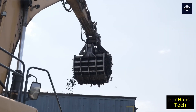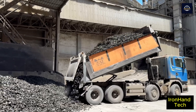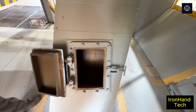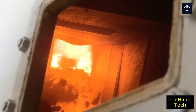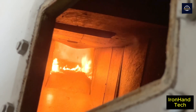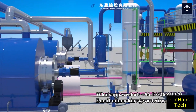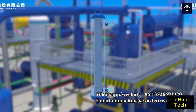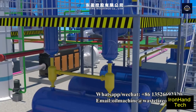The tire pieces are transported to the pyrolysis area. The purpose of this is to decompose the chemical bonds in the rubber to create simpler products, mainly oil. The rubber is fed into a reactor where the temperature is 450 to 500 degrees Celsius and there is no oxygen. The large rubber molecules are broken down into smaller molecules such as hydrocarbons, which are then converted into vapor and gas — producing oil gas and solid byproducts, with oil as the main product. The finished oil then goes through a filtration and refining process to improve quality and remove harmful compounds.